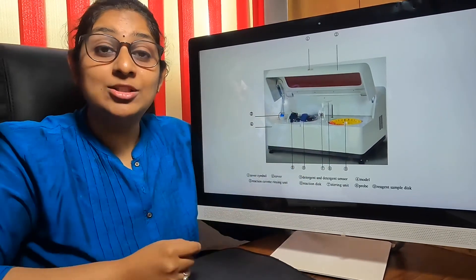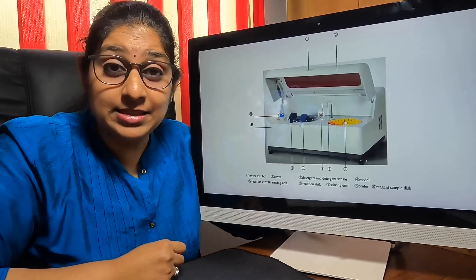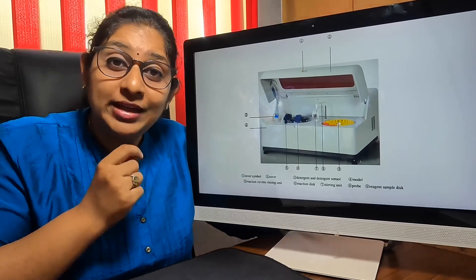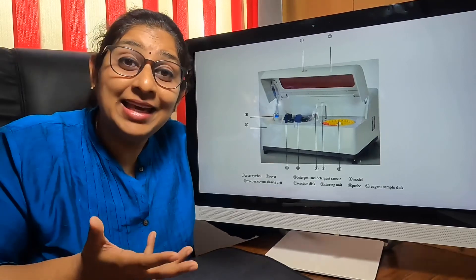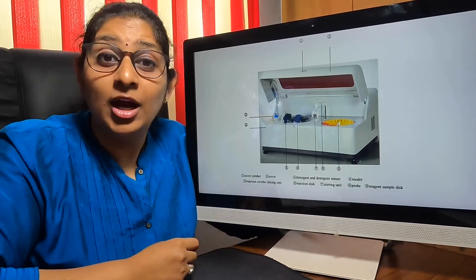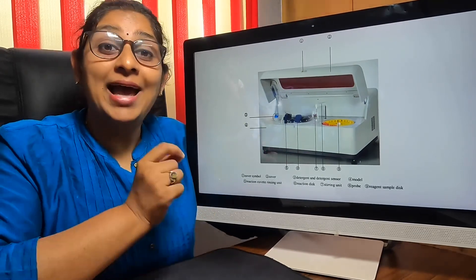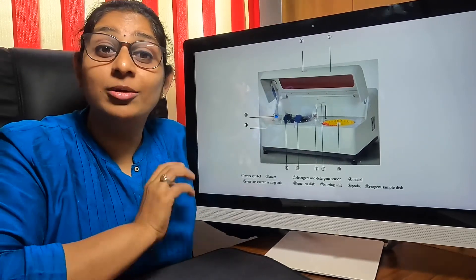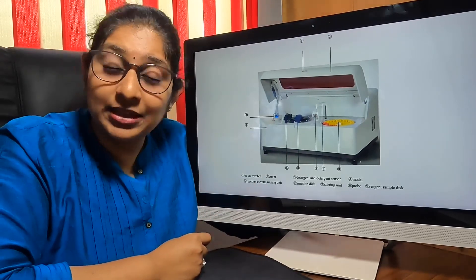Both the detergent and the antimicrobial solution must be phosphorus free. Why it needs to be phosphorus free is that phosphorus is a hazardous pollutant to water bodies. When you release phosphorus into the normal sewage system of your city, it can form algae and make the water harmful for consumption or for larger water streams. Thereby, you should always buy the antimicrobial solution and the detergent solution from the company's manufacturer or distributorship, and not from any local suppliers, so that there is no added phosphorus in the detergent solution.